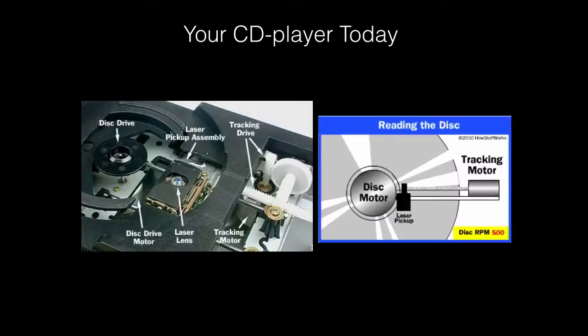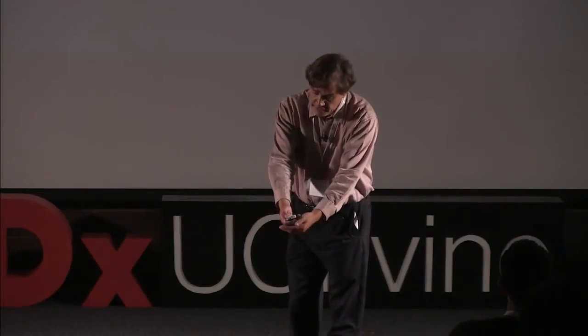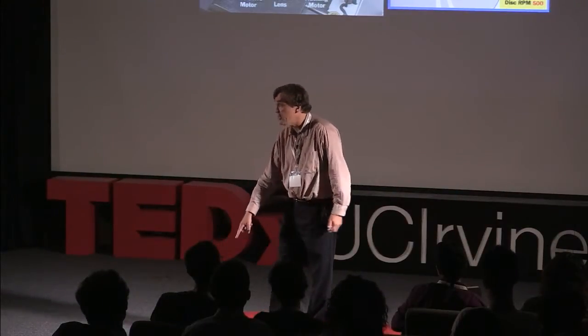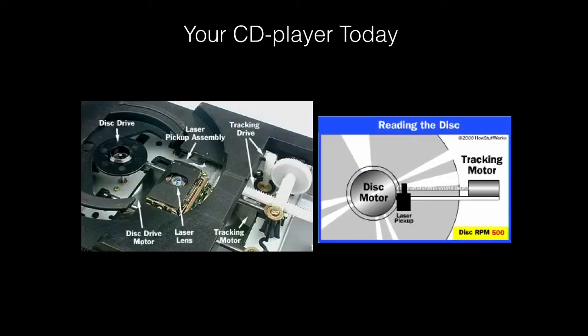We're going to do something very different with it. There are two motors in the CD player: one makes the disc spin round, and another one — a linear motor — makes it such that the laser can go to any position on that CD. Why is that useful? I will instead put a DNA array there and my laser will be able to go find it, because it's a platform that allows you with micron accuracy to find a spot. Each spot is indexed. We will use that. This is like an XY platform.